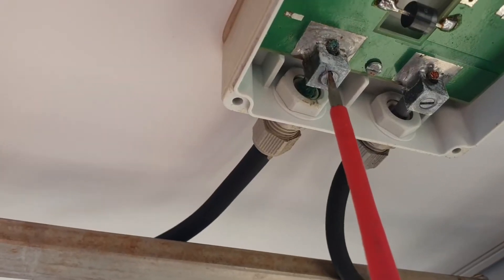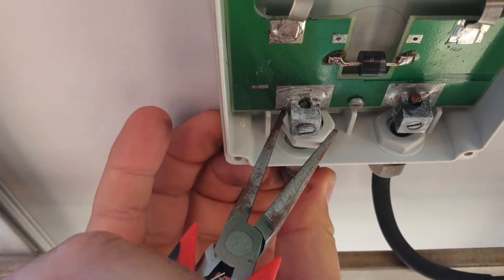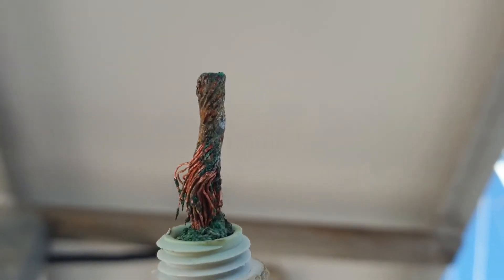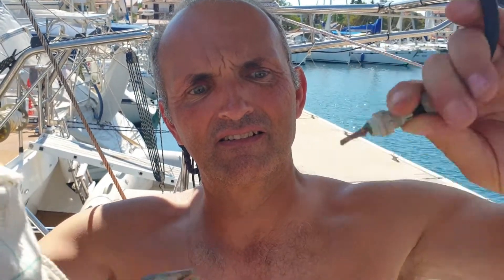What I'm going to do is clean up the connections — make them all nice and shiny and tight and clean — and then we'll try it again and see if that fixes the issue. The best way is to chop off the damaged section, strip it back, and reconnect. You can see how green and corroded that is — that's not going to be a good connection. The end of this cable is soldered, and since I don't have a soldering iron I'm just going to clean it up by scraping and making it as shiny as I can for now, and fix it later when I've got a soldering iron.